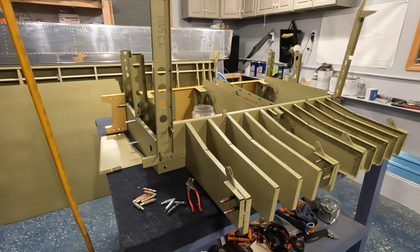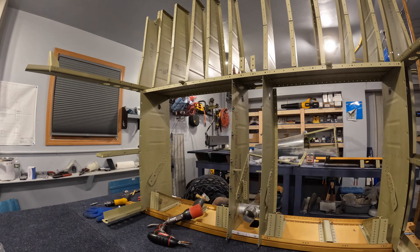I have everything here pretty much clocked in place. I'm about to dimple the holes in the bottom rib flanges for the bottom mid-fuse skins. A little bit of confusion — I had to re-read the instructions a couple times, but right where I took a marker and circled is where you countersink. You don't dimple — everything else here is a dimple except the anodized spar, which is thick, so obviously you countersink that.